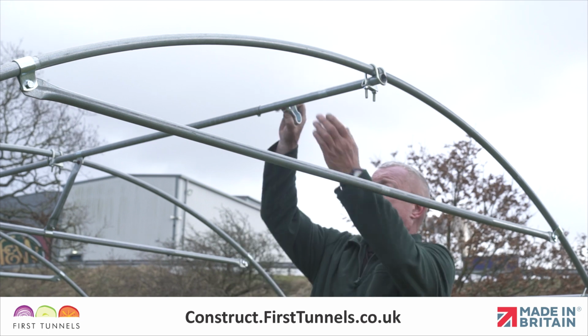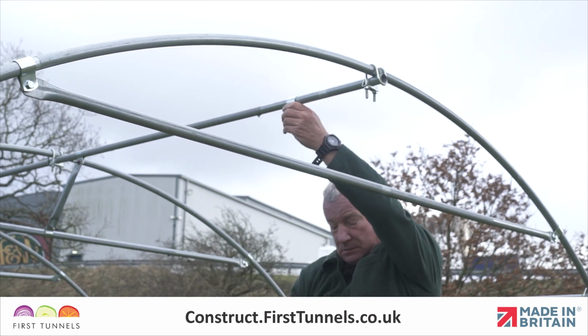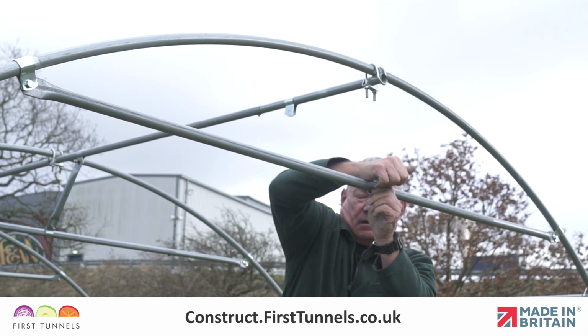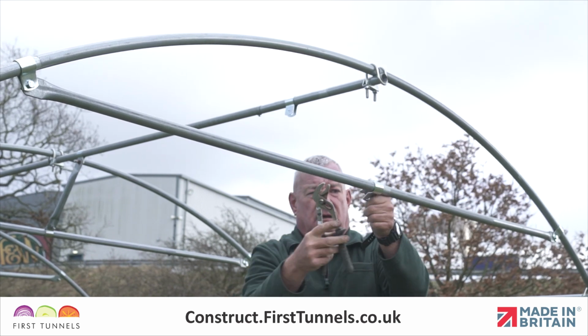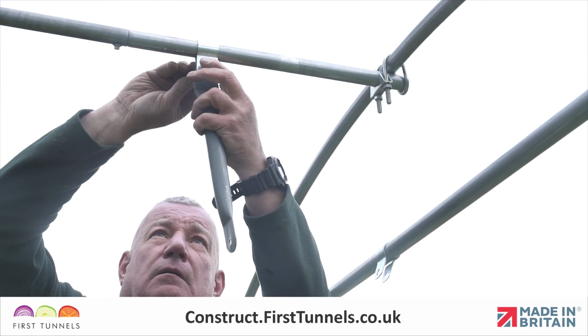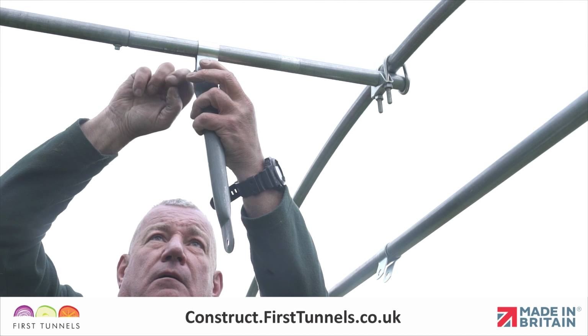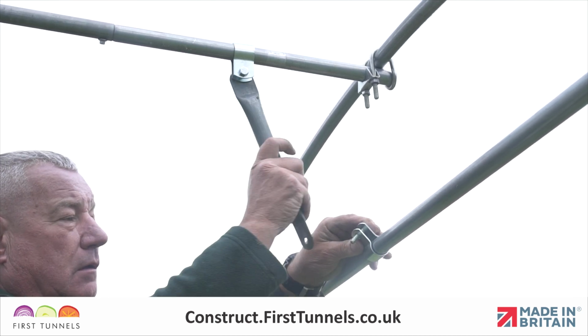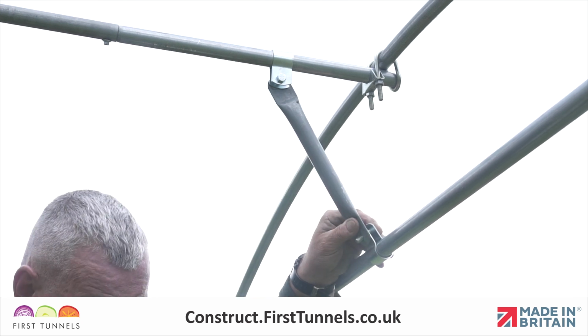Fit a Q-clip to the central ridge. Fit another Q-clip to the door rail. Locate one end to the Q-clip on the central ridge and loosely secure in place with a bolt and nut. Now locate the opposite end to the Q-clip on the door rail and firmly tighten.